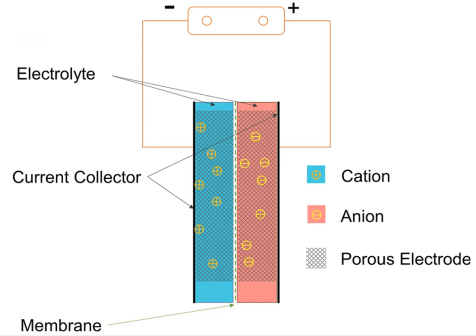they have a higher dissociation voltage of typically 1.35 volts per electrode, 2.7 volts capacitor voltage, and a higher temperature range. The lower electrical conductivity of organic solvents, 10 to 60 millisiemens per centimeter, leads to a lower specific power, but since the specific energy increases with the square of the voltage, a higher specific energy.